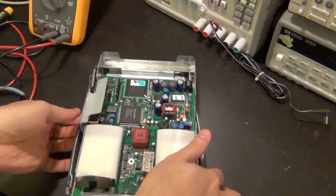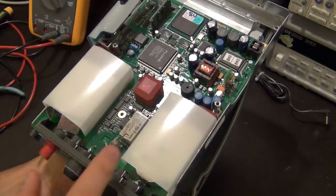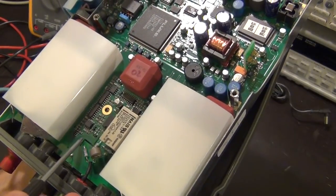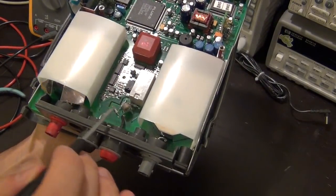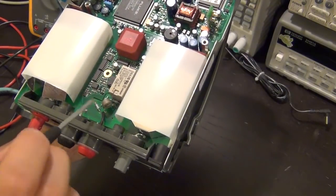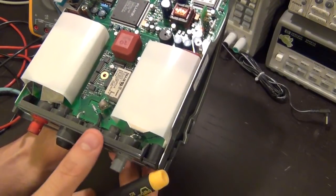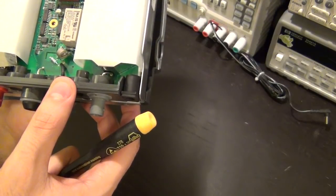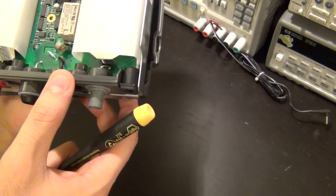And here in the front we can immediately see there's a range relay switch, which I'm sure will click depending on what you're measuring, and there is some good input protection here. You can see that they've cut out the PCB. This is typical stuff, I'm sure you've seen it many times. There's a spark gap here that will absorb any high voltage surges that may come in by zapping them to ground, essentially in a controlled fashion. The relay that's there is rated for 30 volts. It switches at 5, but doesn't say the current.